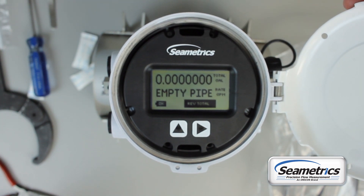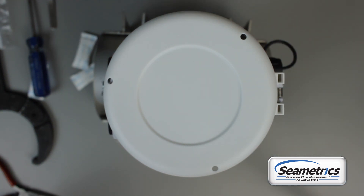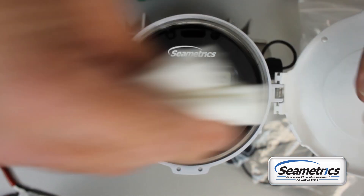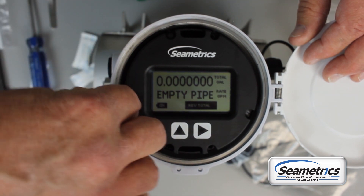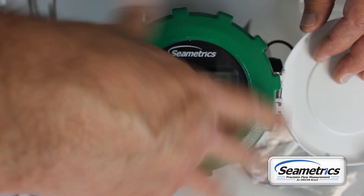Inspect the o-ring on the lid. Make sure that it's not too dirty and make sure it's not cracked. There is an o-ring in your battery replacement kit if it is damaged or dirty — replace it and make sure it's clean. On the o-ring sealing surface inside the housing, clean that surface. If that meter's been out in the field, it's going to be covered with dirt and sand. Clean that up so it'll seal well — too much dirt and it's not going to seal properly.